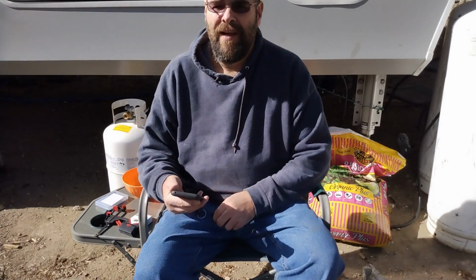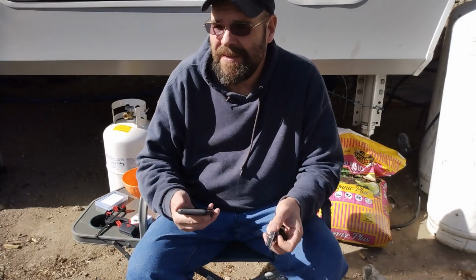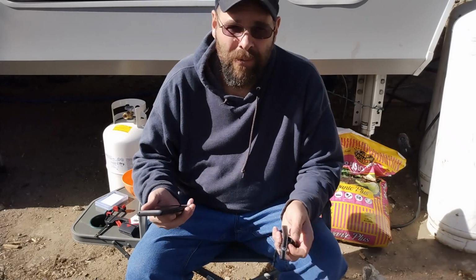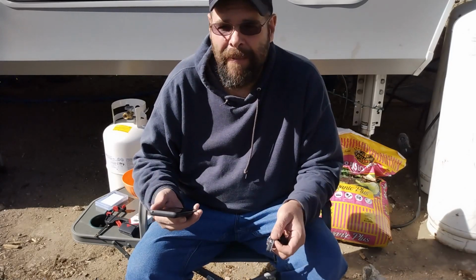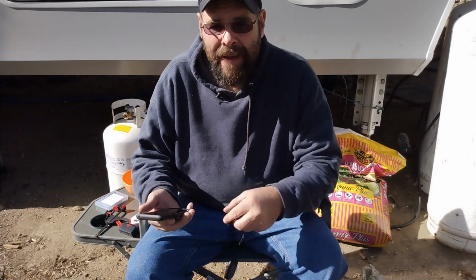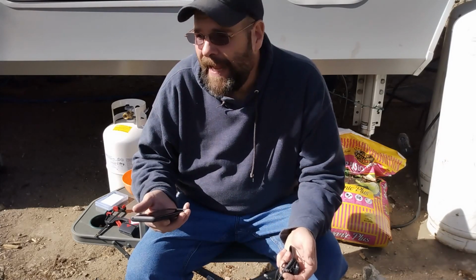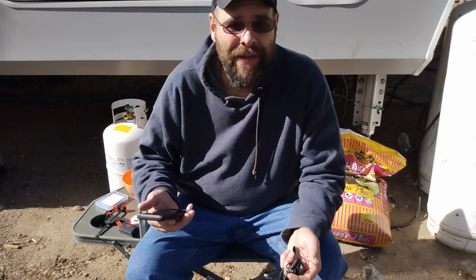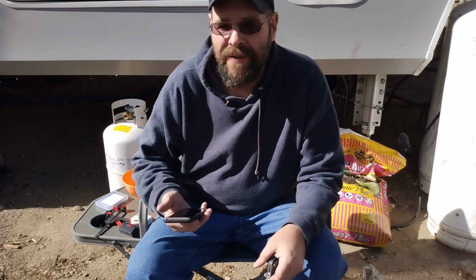One possibility, and I don't know, I'm just asking questions: did they use old cells, grade B, or worse, grade C? I don't think so, but I don't know. More than likely though, did they use 280 amp hour cells, and it pulled 283 and did a great job, and they sold it as a 300?